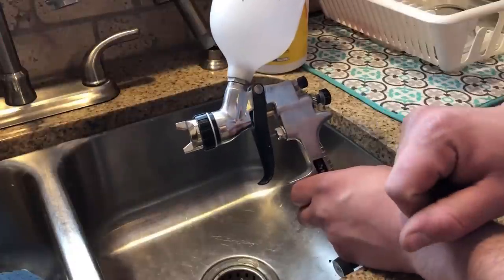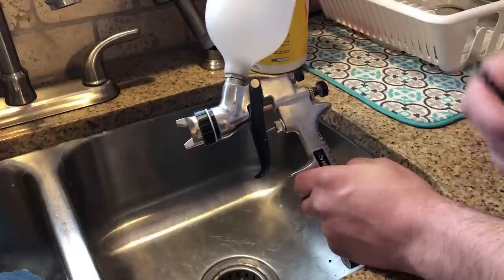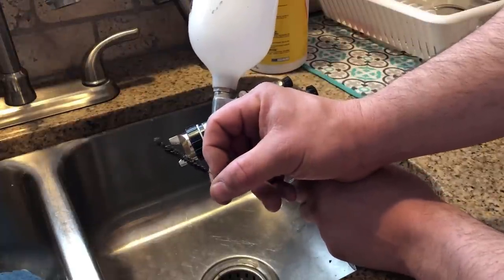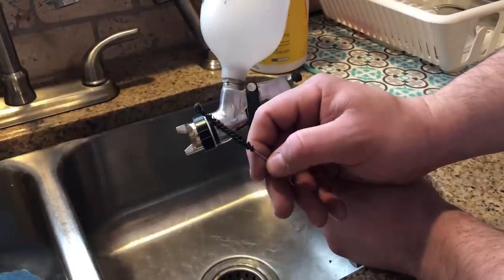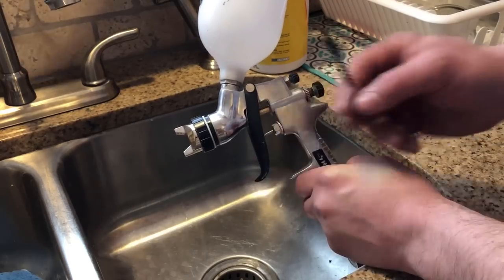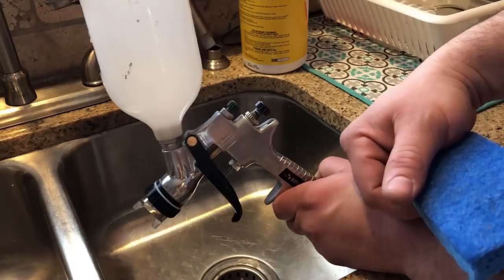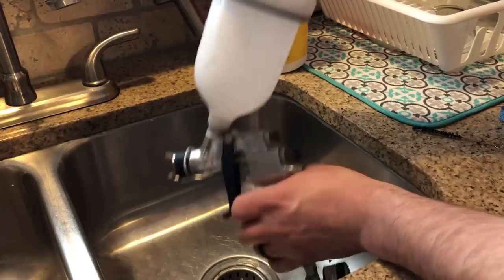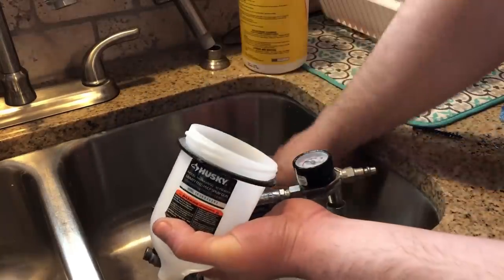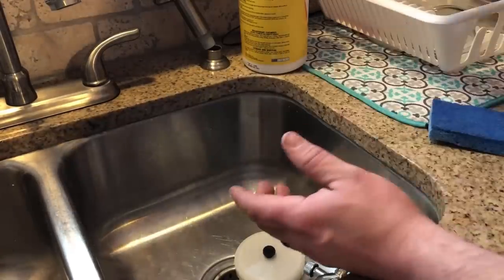Come over to the sink — turn the water on, running warm to hot. I usually put gloves on, but since this is a clean gun I'm not worried. Spray guns come with a cleaning kit that includes a set of small brushes. The stiff-bristle brush is the best for getting stuck-on paint off the inside. I also use a normal kitchen sponge. To start, pour any old paint down the drain, unscrew the top, clean the cup with the sponge, and set it aside to dry.